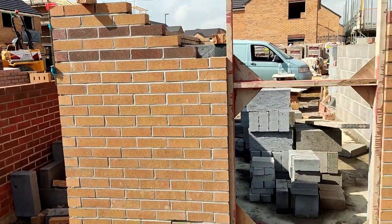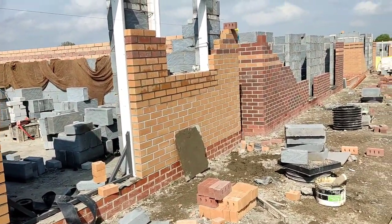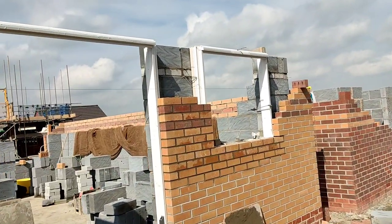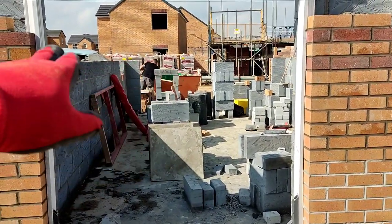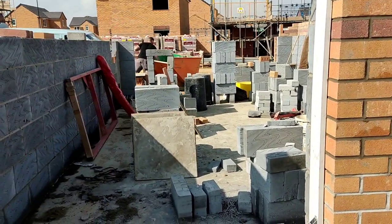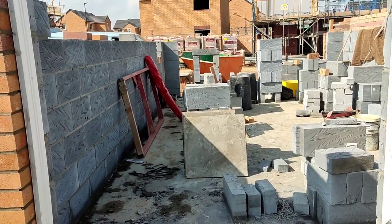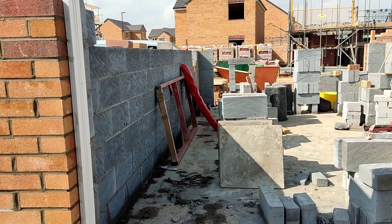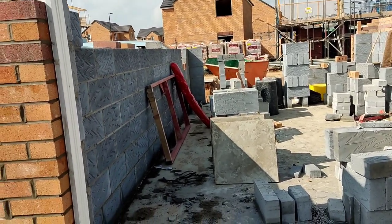That's what we got done. All backs up. Leave a few racked from the top, just makes it easier with window frames and whatnot, get them set nicer for next lift. So all that brickwork's up, blockwork's up to full height. And we're going to start on the front brickwork tomorrow. I might shove a door frame up that front. Build that front little peak as well, front little block pillar, six course, and then away we go. My goal tomorrow is get the front up. I guess the mixer's on tomorrow, we build the front, so get the front up in a day, I'll be back on track again. Right, see you next clip.